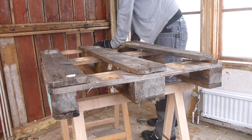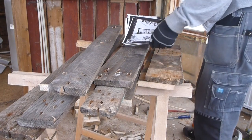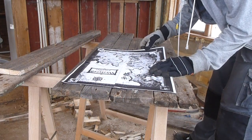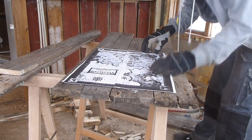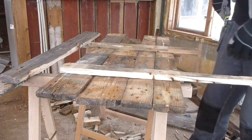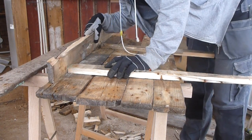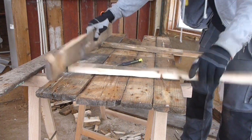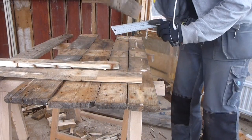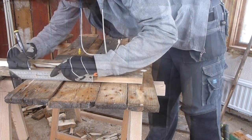So let's get started. When all the material is gathered from the pallet it's time to make the tabletop. For this I chose 4 nice and straight planks and lay them next to each other. By placing the image you are going to trace later on top of the planks, you can easily see if the tabletop is wide enough. Then we need to hold these planks together, so for this I used damaged pieces of planks. I also wanted to add a skirt or standing planks around the bottom side of the tabletop, so I leave some space large enough for the standing planks and then cut the scrap pieces in length.